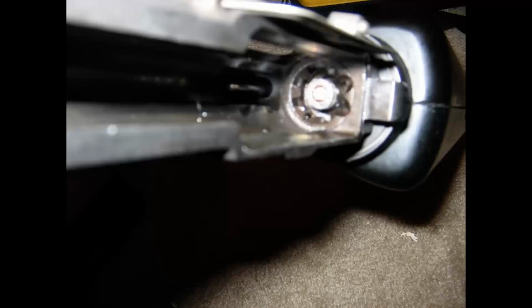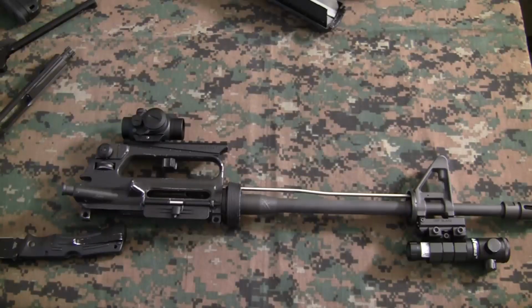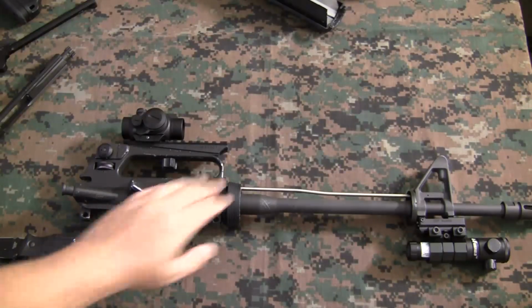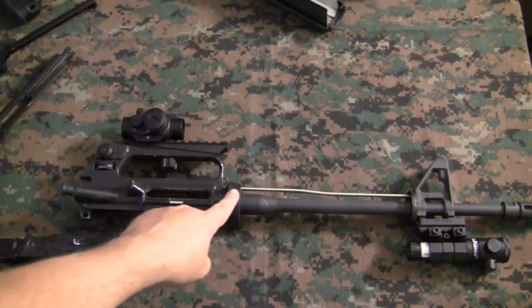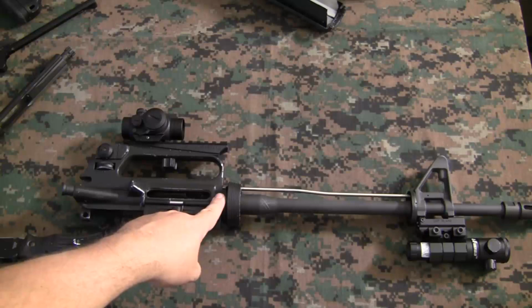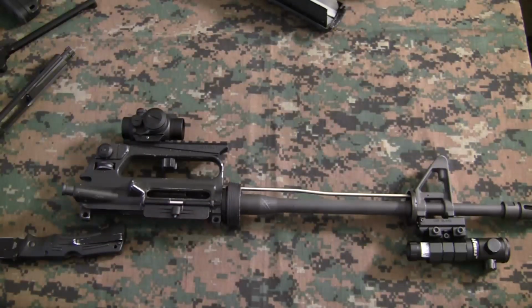Now, once they figured this out after a long trip through Congress, the Army was trying to blame it on the troopers because they were all draftees and thought they could get away with it. They basically fixed the problem. In the Army, they switched to a cleaner burning powder. They adopted stainless steel or aluminum gas tubes. The chamber was chromed and the barrel was chromed, which they weren't originally to save cost. And chrome is extremely resistant to corrosion and a lot easier to clean, and is pretty much resistant to lots of forms of carbon buildup. So basically they fixed the issue.